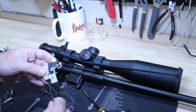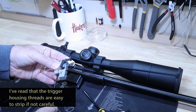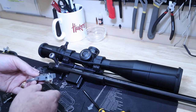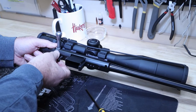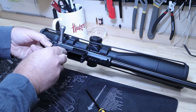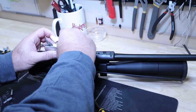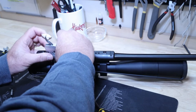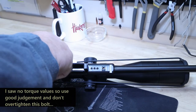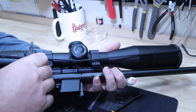I'm going to put that new spring down in there. When putting this back in, make sure you're not cross-threading. I'm going to screw the adjustment screw in quite a ways to make sure we have enough clearance for the trigger housing bolt. Then the trigger goes back in — making sure I'm lining this up so I don't strip anything. Now I'll tighten that down, not too tight but tight enough.